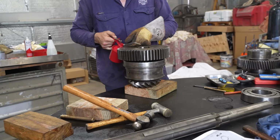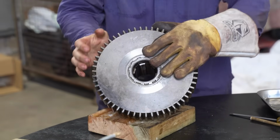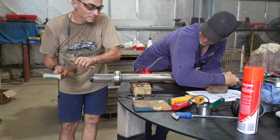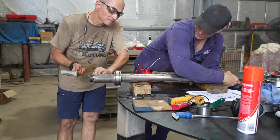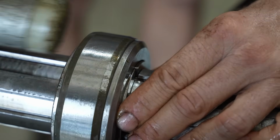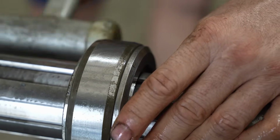While ducking over to the office to change the SD card, the boys got reverse gear fitted to the unit. I was assured that I didn't miss much. Finally, there's a precision fit bearing hit down hard against a two-part washer. The washer has to be in two parts so that it can have an inner diameter small enough to lock into the groove in the main shaft.